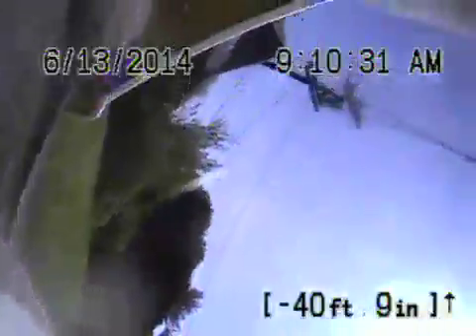As we continue coming back, the rest of the 4-inch pipe coming back doesn't look too bad — fairly clean, in fair condition. Then we transition to ABS plastic pipe. This is all good in the backyard. It's basically ABS plastic all the way up to that wall and then it transitions back to clay. This is all good pipe coming back, coming up out of the clean-out. Here we are once again in the backyard — sewer goes straight out where that wall is.